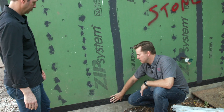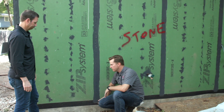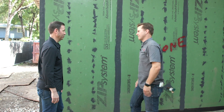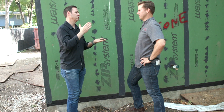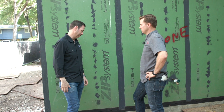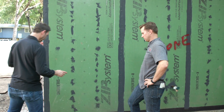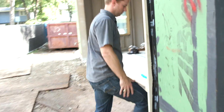The reason we do this — this is a very leaky detail right here at the base of the wall. This makes it nice and airtight. Right down here there's tons of air that gets leaked through. So if we can get that air barrier all the way down to the foundation... I found out the hard way on a callback ten years ago where I thought the sill sealer foam was going to do it, and I had an air leakage callback that was really embarrassing and very expensive to fix. So you're doing this air sealing on the outside so that we're not as reliant on foam on the inside.